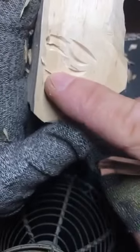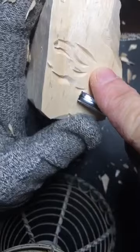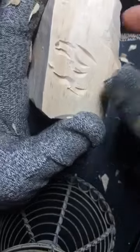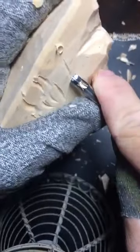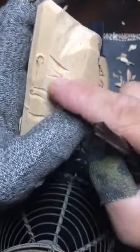I also do that technique with separation of clothing. Don't be afraid to lay that V-tool on the side, because when we come in straight and then have to come back with our knife and cut into that cut, we've wasted two, three, five minutes however long it is. So that's what I do with a V-tool as opposed to just what I call the arrow in the corner of your elbows — we're laying that guy over, giving him some definition, as opposed to just straight cuts.